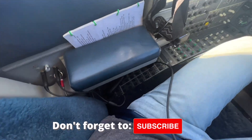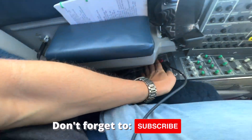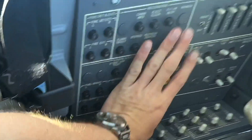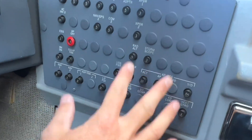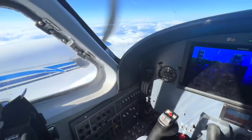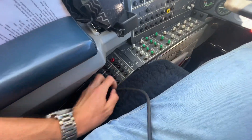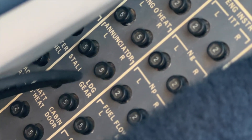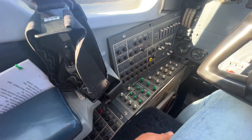Over here we have our circuit breaker panel. It extends all the way back here to kind of where my seat is, all the way up here and then all the way over here. And not only are there circuit breakers here, but there's also circuit breakers on this side. This side is more for all of our avionics and some accessories, the autopilot, all of that sort of stuff. Over here we've got mostly some of our accessories for the back, we've got all of our engine circuit breakers, a lot of our other system circuit breakers — landing gear, auto feather — all that kind of stuff that's important for operating the aircraft, and it's on this side because we need quick access to it if we need it.